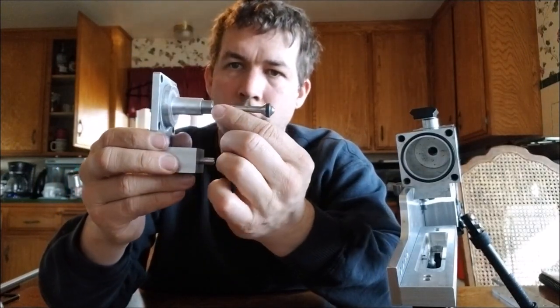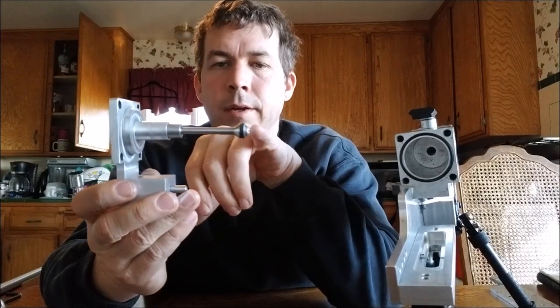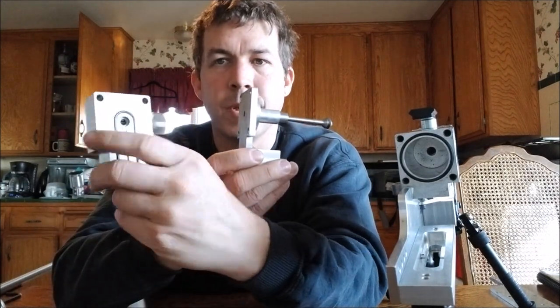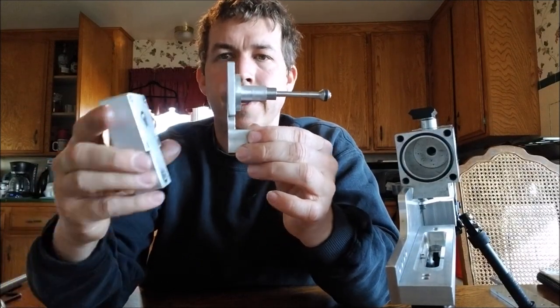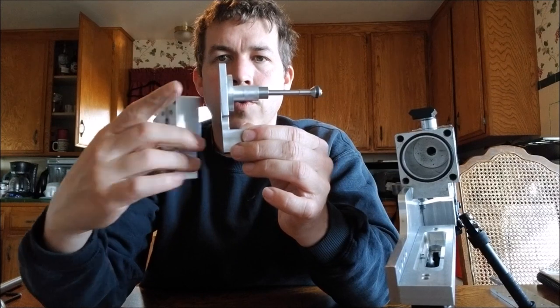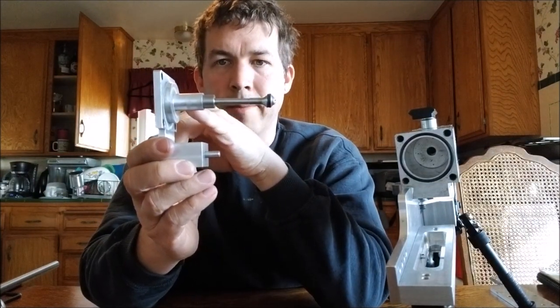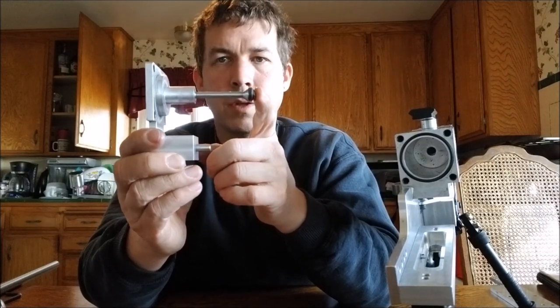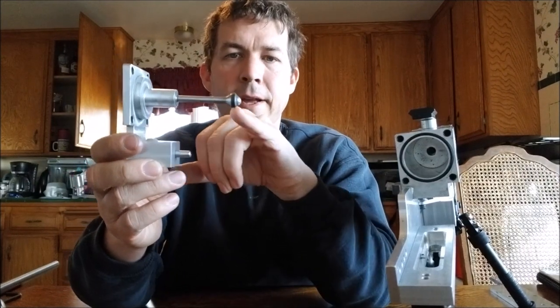That hole vents out to the barrel. I made the piston intentionally undersized — a little loose — so air leaks around it and fills the chamber with whatever pressure I'm using. The valve is now balanced: high pressure behind the piston and high pressure in the free space behind the valve, holding everything closed. When the trigger is pulled, it opens the valve and vents all the pressure behind the piston. The moving air creates a low-pressure zone — lower than atmosphere — and the piston falls into that zone. The o-ring seals to prevent extra air loss and acts as a bumper so the valve doesn't slam into the aluminum. All the air inside the chamber then vents out the barrel through that hole and pushes the bullet.